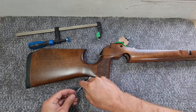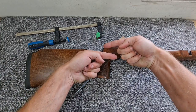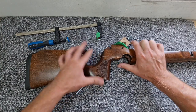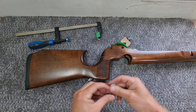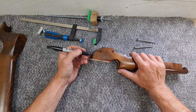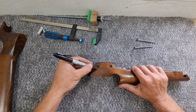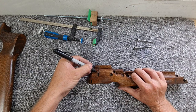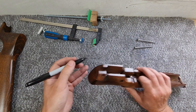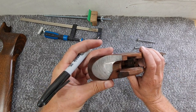You can't just use one of these clamps on its own because it will pull the stock one way, and if you clamp that up and tighten this one up it will slide the two sections apart. So I need to have the two clamps going across each other so that it stays where I need it to be. The plan is to put the fix in about here, so what I'm going to do is take a cut with the router and remove this inside midsection here.